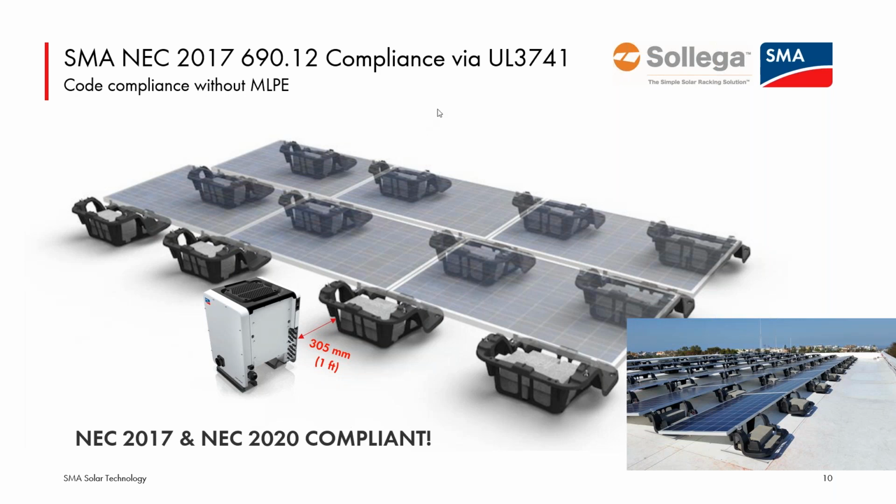So for us in the States, this UL 3741 listing is primarily driven by the racking manufacturer, not the inverter manufacturer. Solega and also the Iron Ridge BX system paired with the Core 1 inverter to get this listing. What this listing is doing is testing potential shock hazards should a firefighter have to interact with a potentially damaged array utilizing this racking system. They're testing to make sure that shock hazard is not significant, even if the array is damaged and a firefighter were to fall in contact with it, or somehow need to put an axe through one of these modules. That sort of fault current, making sure there's no undue shock hazard.